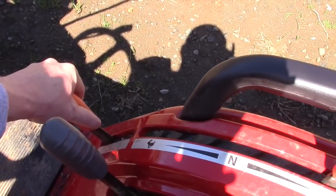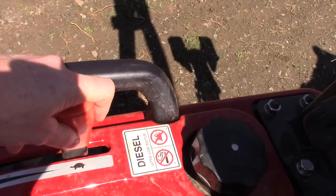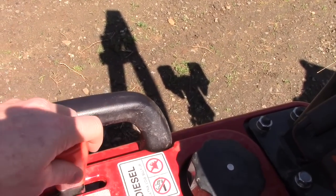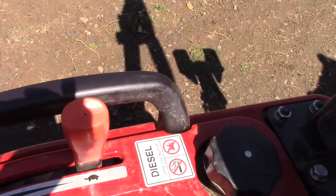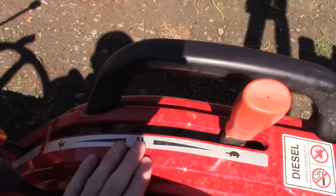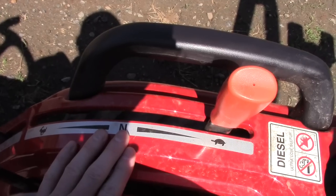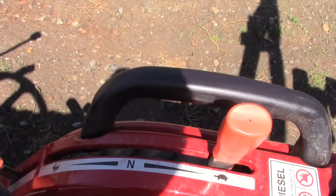The four-wheel drive lever is here. Your high and low speed controls are here on this side. The tractor won't start unless you're actually in neutral, so always keep that in mind. You really have to be mindful to always set the parking brake.